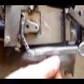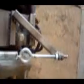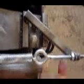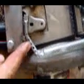So I'll be able to adjust how far the collar closes, how far the collar opens, and then with the spring here, I can change these springs. I got these at Home Depot. I had a couple different sizes. This is like a 15-pound spring, I guess. With this adjustment here, I could probably make it a little stronger. Depends on how much I turn this and shorten or lengthen this. And then each one of these holes in the lever arm, again, it's like a drift pin I bought at Home Depot as well, can fine-tune whatever adjustment is, or whatever poundage is in the spring.